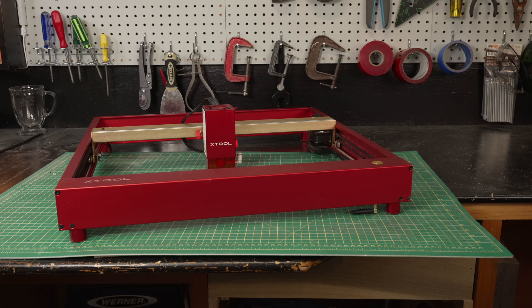I'll start with a diode laser. Diode lasers are those blue lasers you've seen. They come in price ranges from about $250 at the low end to close to $2,000 at the high end — all US prices. They are very good for cutting most wood materials as well as engraving similar materials, and you can also engrave natively on stainless steel without any kind of treatment. What they're not good for is cutting or engraving things like clear acrylic, which most people might want to do, so it could be a big drawback if you want to make any kind of lighted sign. But they are definitely the easiest and cheapest way to get into laser engraving, and it's the one you might want to start with.